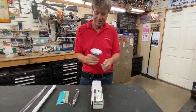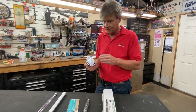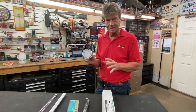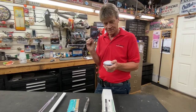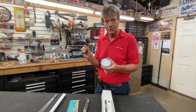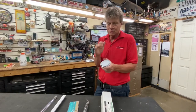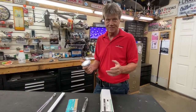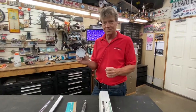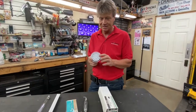Here is our Lightspeed bulb. When we developed Lightspeed, which started in 2008, the first problem we ran into with using LEDs was that one-color LEDs, because the nanometer range is so narrow, will not do a proper job of exposing screens. Polymers work okay, but if you need to do any other kind of screens — your dual cures, your water-resistant emulsions — this is the only way to properly cure that, because there are two different nanometer LEDs in each lamp.